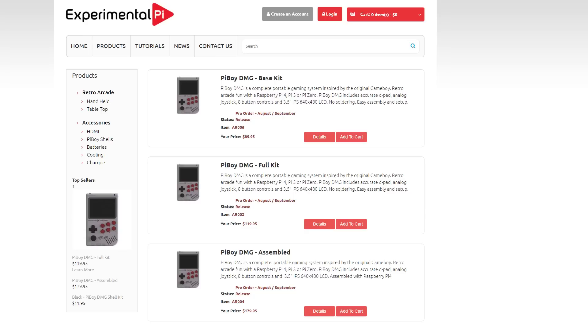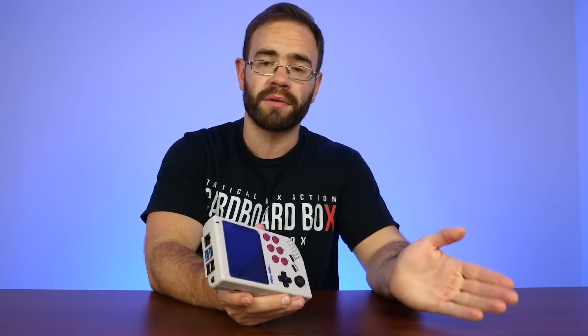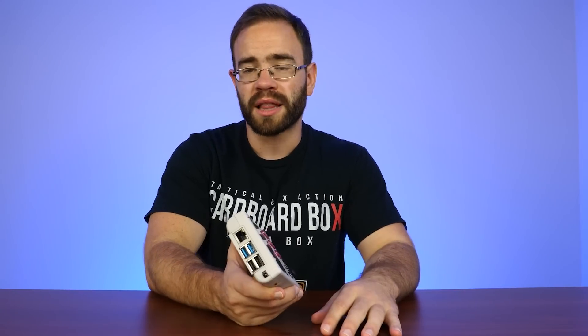Let's talk about this casing. On their website they have several different kits you can get. If you already have a Raspberry Pi 4, you can just buy the kit itself, or you can go completely all out and they'll have everything assembled for you, showing up just like this one did. It already has a Raspberry Pi 4 installed and an SD card loaded up with RetroPie — you just need to provide your own games. It even came with a full 5-volt 3-amp power adapter, though it does use micro USB, which is a bit of a downer. USB-C would have been preferred, but you're mostly just going to use that to charge anyway.